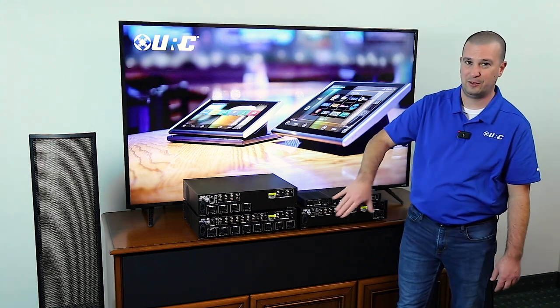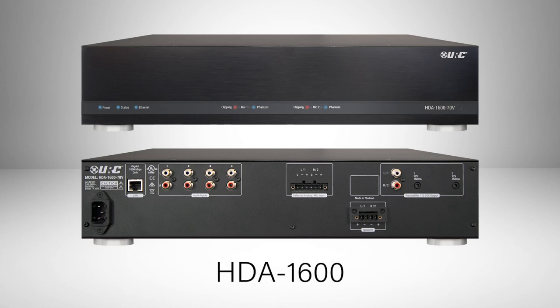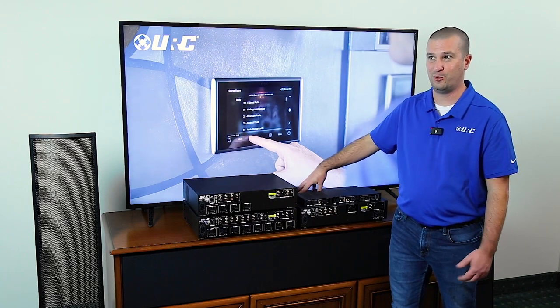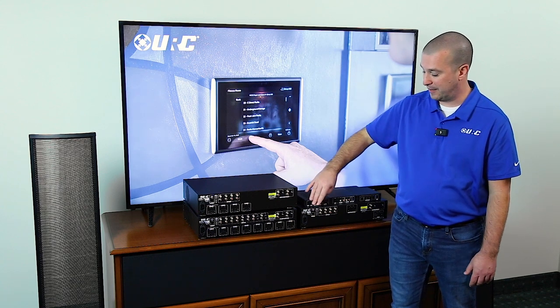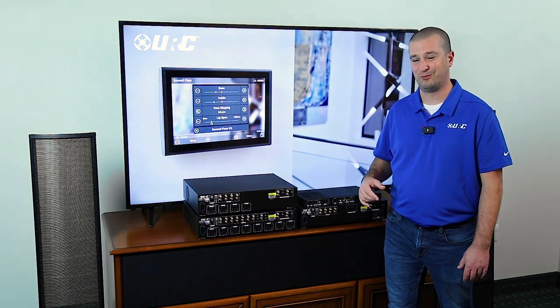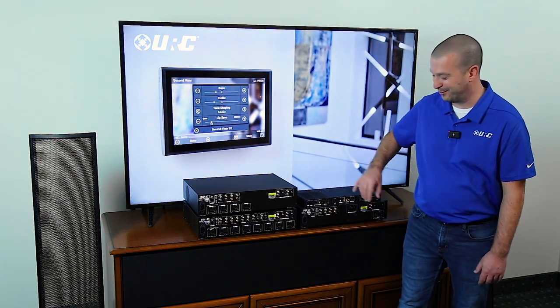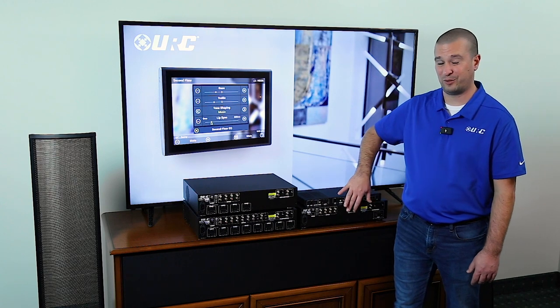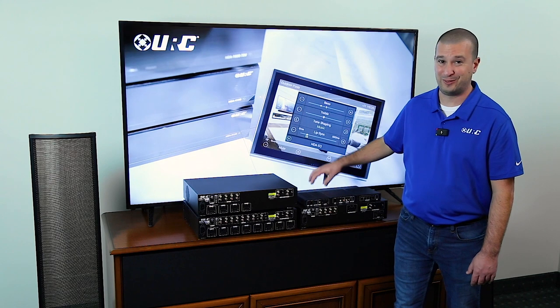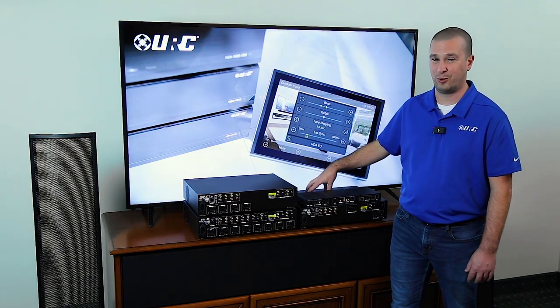We also have a big 2-channel amplifier. And this piece is kind of like a Swiss Army knife because not only does this run regular low Z, 8 ohm or 4 ohm, this will also run 70 volt and it can run mix mode. So if I want to run 70 volt satellites, think about a landscape package or some pendants and a subwoofer, I can run that 70 volt channel and then I can run low Z to my subwoofers because subwoofers and transformers are not the best of friends, that it can be very flexible and it has the crossovers for those channels independently.